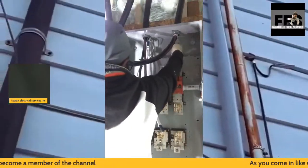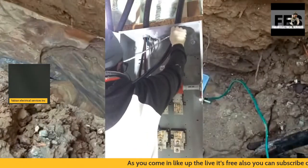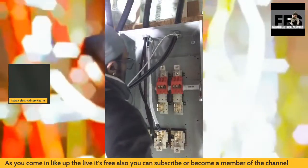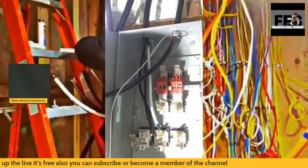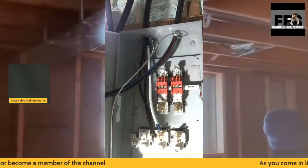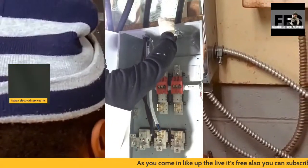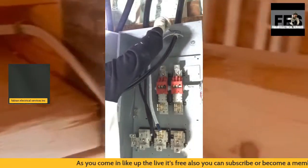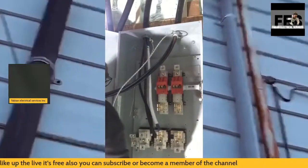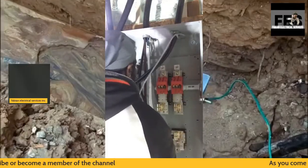As you can see, the reason I stated that I like to keep the white paper on is that it simply helps with the cable. As you can see, the cable is locked in place. Once you disassemble that, it gives you a lot more problems getting the cable inside of the connector. So that's why I always make sure I land my cables inside of the disconnect, inside of the connectors, and then I make sure that I remove that.